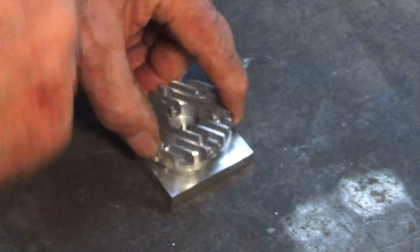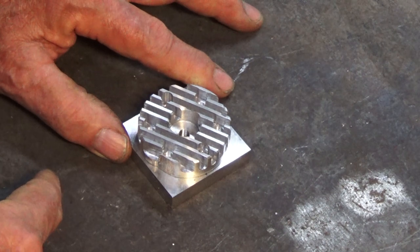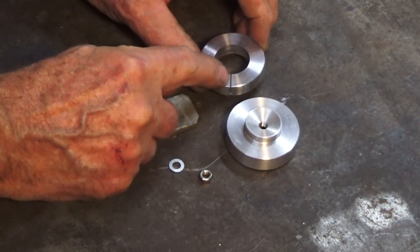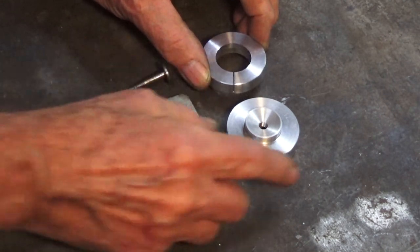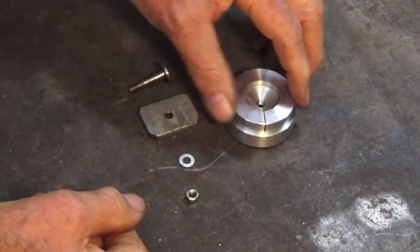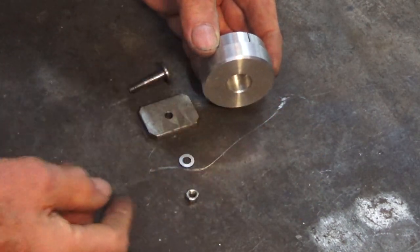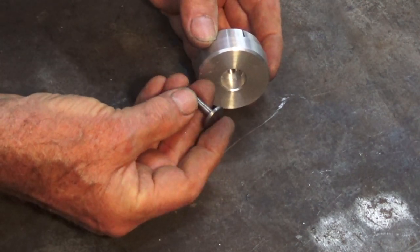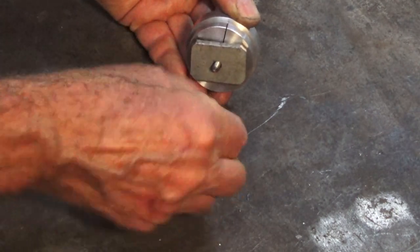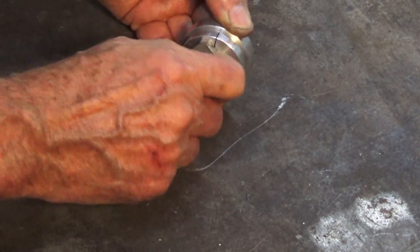We're going to do it now in the Bridgeport Mill and we're going to use a slitting saw to cut all of these grooves — the construction notes say you can do that. I've also redesigned the fixture. This is the cylinder head blank that we'll be doing today, and this new fixture is going to get gripped in a three-jaw chuck, which will ensure the slot closes up. The fixture is also pretty tight on the bottom side of the cylinder head. And just to ensure that when we start cutting there's no chance of pulling the blank out of the fixture, I've got a flat-headed screw that fits through where the glow plug will go, with a plate on the back, and a washer and a nut — just a bit of insurance to make sure everything stays as one single unit when we start cutting.